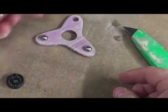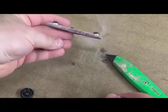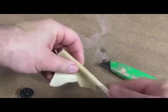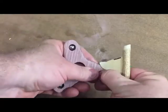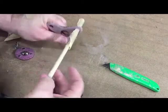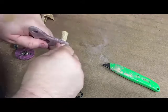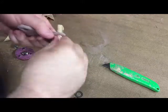These outer ball bearings are going to go right in those little holes. You do not want to force these balls into the hole - they are not going to fit as is. So what we're going to do is take a dowel right here and put some sandpaper around the dowel and work it back and forth in those holes until they fit. We drilled this out with a 7/16th and this is a 5/16th dowel with a little piece of sandpaper wrapped around it. We're just going to spin that around - you can also use it on a drill, but I'm just going to be patient and do it by hand. Take this off every once in a while and come in from the other side.